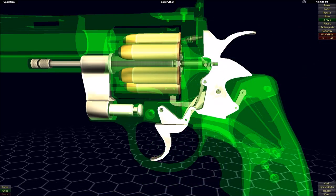The next firearm we're going to take a look at, the Colt Python, is an example of an additional feature in a hammer-fired system: double action mode. Like the single action system where the trigger pull achieved a single action — the dropping of the hammer once it was cocked — the double action system will complete two tasks with a single trigger pull: bringing back the hammer to the cocked position and then dropping it, all in that one trigger pull.